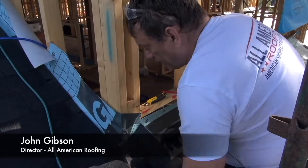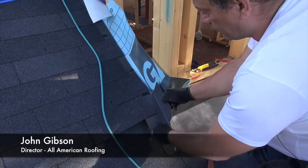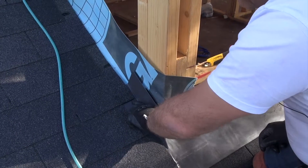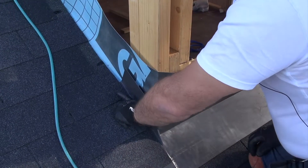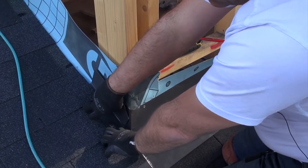So this step flashing here at the butt of the course of shingles is when we shove another one in. These step flashings should go above the next course, the butt of this one. The code requires it to be just 50mm because water will seep up this way about two inches.